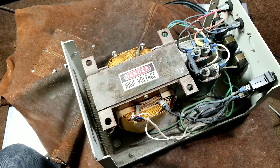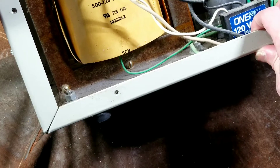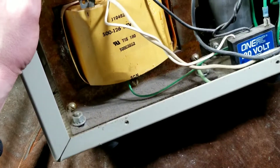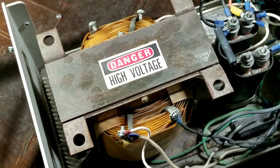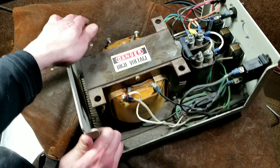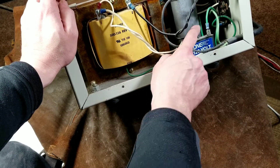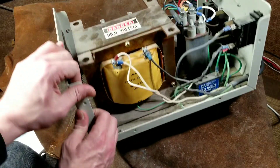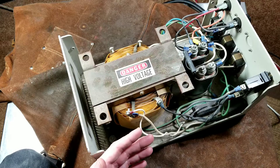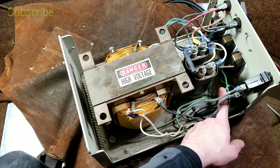There's a circuit breaker power switch inside. They also have what they call the VG 2000 — that's the surge protection module on the input side. It's not little flat discs like MOVs; it's a big box with both the hot and neutral line going to it and a separate ground wire coming out. That is the avalanche diode based surge protection — it can really be considered a 200 volt voltage limiter that shunts anything above that back into the ground wire.